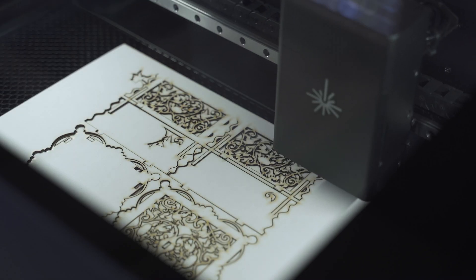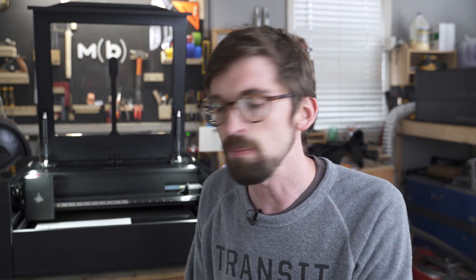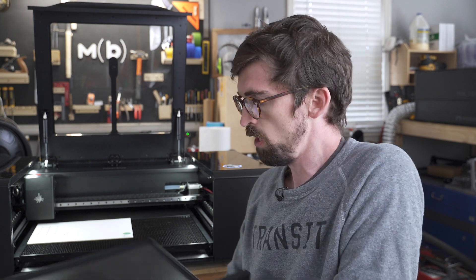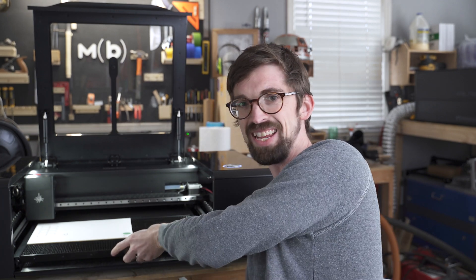Everything runs on linear rails, which is really nice — the speed is not only quick but super accurate. The actual bed is a honeycomb design with screws on the outside, so you can replace it as needed. One thing that's super useful — and I wish was on all lasers — is that the bottom is removable. It's not a pass-through, but when you remove it, as you're cutting especially small stuff, lots of little things drop through the honeycomb and it's a pain to clean out. Rather than unscrewing the honeycomb to get to the base, you can just pull the bottom out, dump it in the trash can — super handy.